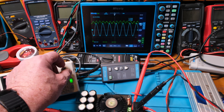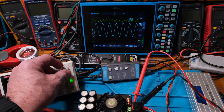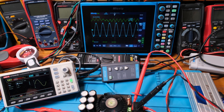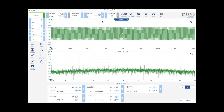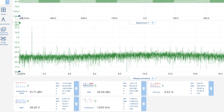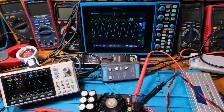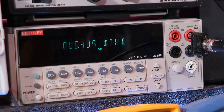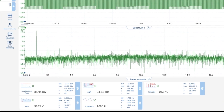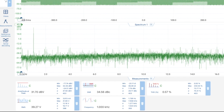I'm going to go over to another digit and see if I can go up a little bit higher. Right about there — I think that's the border. I'm right at 40 volts on the output, and I'm at 0.334% distortion. So we haven't started climbing up in distortion. The Pico's at about 0.5 — kind of bouncing around, just like the Keithley. The Keithley is a little more steady, about 0.33. The Pico's about 0.47 to 0.58. So there we are — that is 200 watts output.